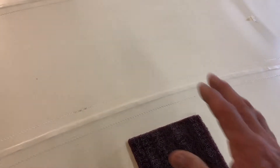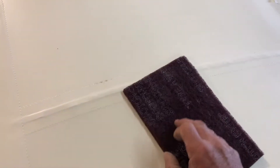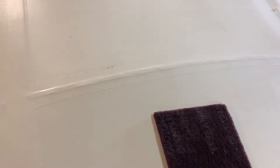After breaking that surface, you don't even have to wait an hour. You can take sandpaper and start right on the primer. Otherwise your sandpaper is going to constantly stop up with grippy spots. Once you knock it over with the scotch pad and break that surface, it goes right to sanding to a dust. Ours is a filling primer, which means we don't go through the process of painting on a brush coat of pink or gray like a Star Gloss system. The actual primer goes into the fabric, holds, and is a good filler.